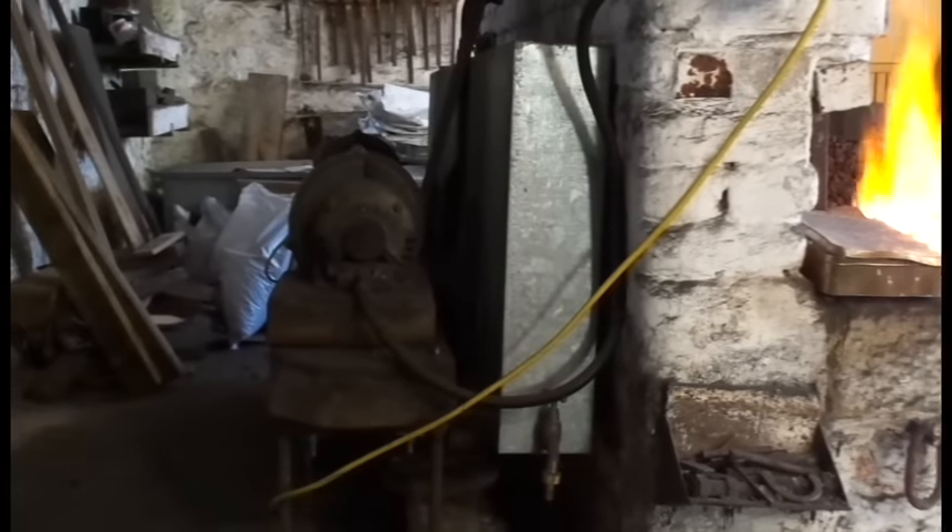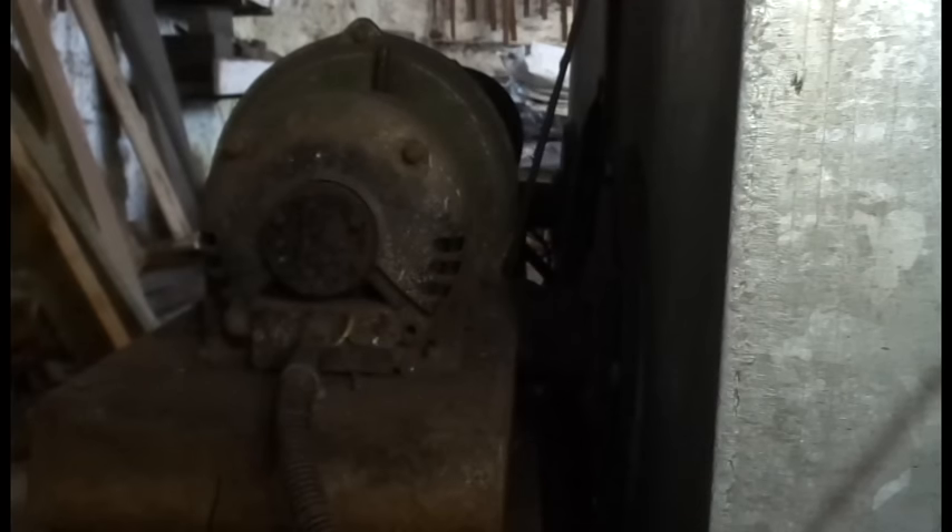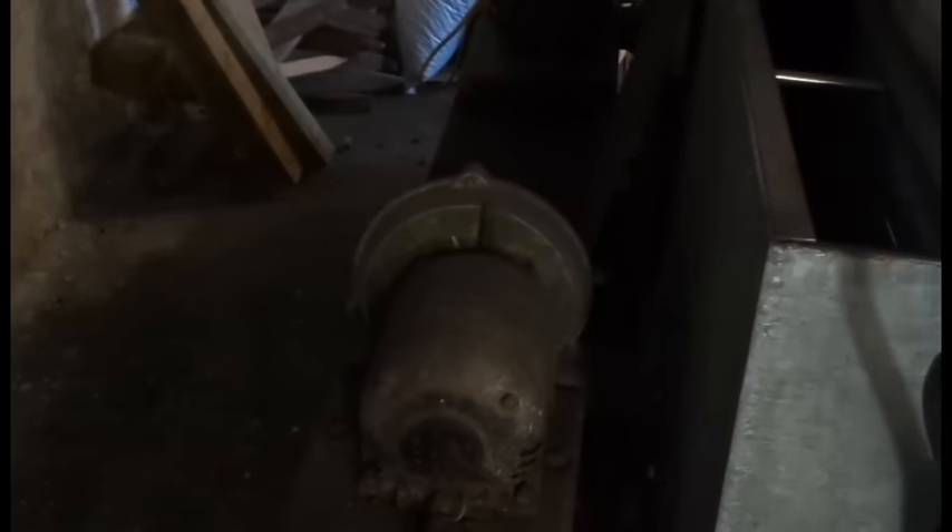My own fire is what is known as a side draught forge. This means that the air is injected into the fire from the side rather than from underneath, as with the bottom draught forge. The fan for the fire is placed at the back of the hearth. The air travels via a pipe which goes through a water-filled tank known as the back bosch. On the other side of the bosch, the pipe joins the tuyere iron, which is hollow and filled with water from the back bosch. This keeps the tuyere iron cool and stops it from burning as it injects air into the heart of the fire.